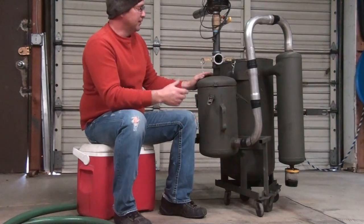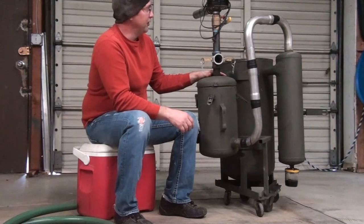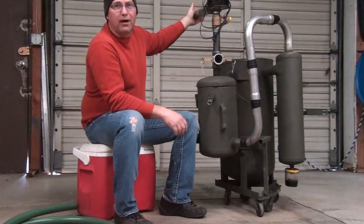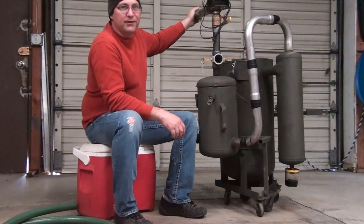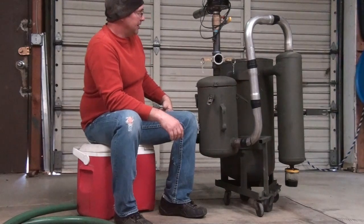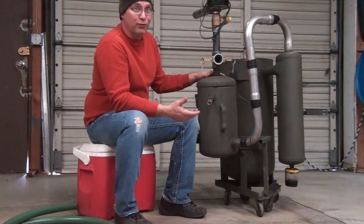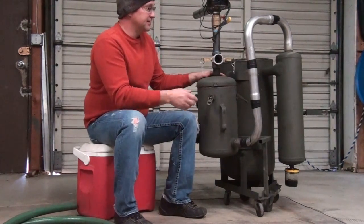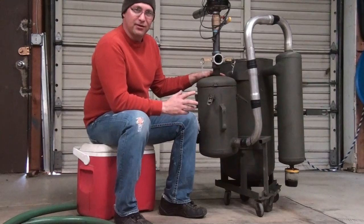When you go to light your generator for the first time - and I'll show this in the next video starting it up and running a generator - as soon as the smoke started coming out I thought it should light right away, but it takes a while. The gas will actually change in color. Mine was brown at first coming out, but after about 15 or 20 minutes it looks like fog: real white, real clean. Then when you light it up it burns great. If you have any questions feel free to email me. I'll always refer you back to Joshua Burks's gasifier videos - everything I know and learned about how to build this I took directly from his videos. They were very informative and crystal clear.